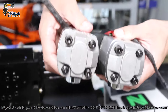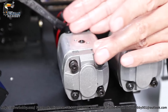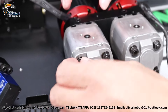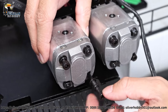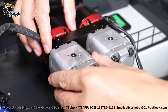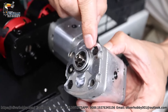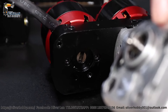Now we're coming to the middle main connection CNC alloy block that connects the valve blocks and the pump block. The pump is secured to this block by two screws on the rear side for the big arm pump. This screw is a special round one because it's near the oil channel. Remove and take out both. That's for securing the rear side pump. The two pumps need to be removed at the same time — the forward pump is secured by these two screws. Take out both screws.